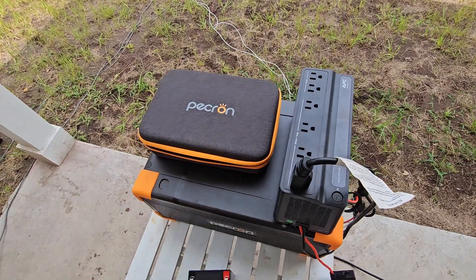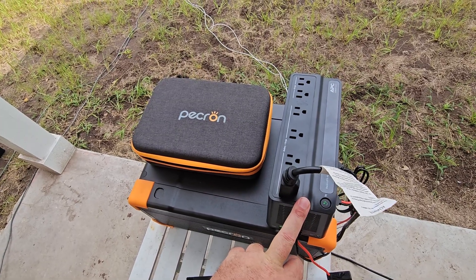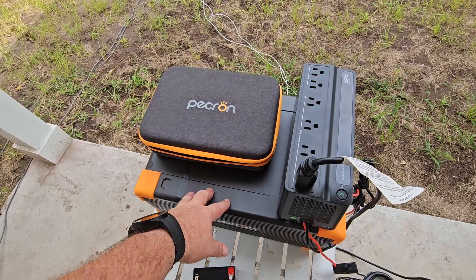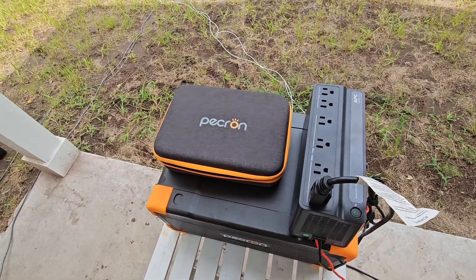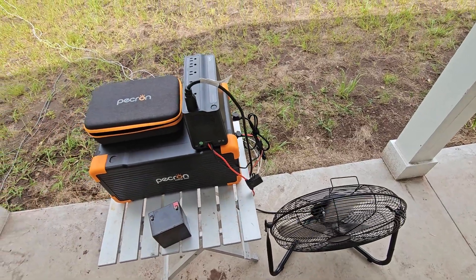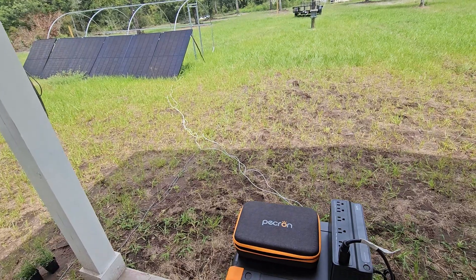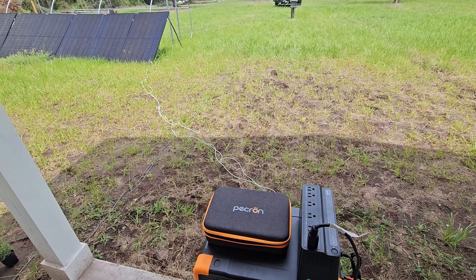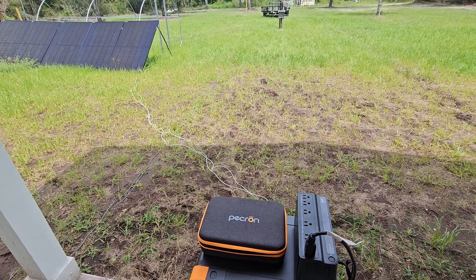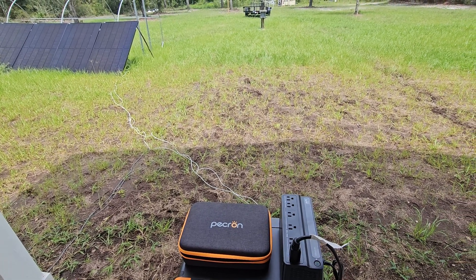This is demonstrating that you can do that and still have 115-volt AC power. I checked it — it's about 116 volts right now with the fan running. With a little bit of math, assuming this is at least 90% efficient, you're looking at running your fans all day and all night as long as you get a little bit of sun from your 400-watt solar panel. Thanks for watching — don't forget to give it a like and subscribe if you want more unfiltered, disorganized content.